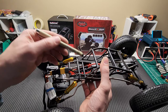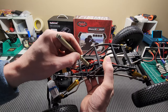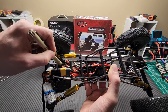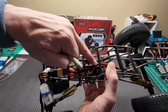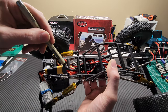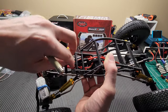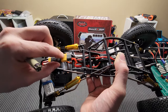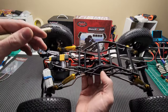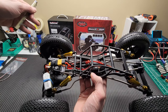My LED lights aren't here yet, but I'm getting LED lights to give me more light in here, which will be better for the next video. These are spliced into — you can see this looped red wire here — that's going to my front motor. I basically removed the battery connector off the rear motor, soldered that to the front motor wires, heat shrunk that, and reattached the one plug. So when I plug the battery in, it's powering both. I also have a small JST connector that goes directly into the battery to power my servo. Channel two, which is my throttle, is my front motor. Channel three is my rear motor. I'll show you how I set that up on the radio.